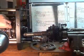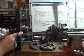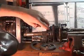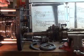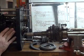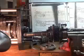You can see it right here — that's the neutral position, and the rest of the shaft can turn independently until this is shoved over. This is a complete running train, taken right out of the car just the way we took it out, so all the pieces are there. There's your little brass ring. If we move it back the other way — now there's second gear. You can see this brass synchro ring; it's loose on here, it won't rotate, but it is loose.